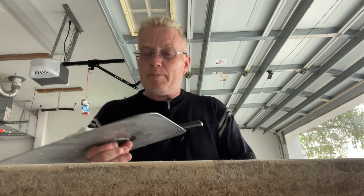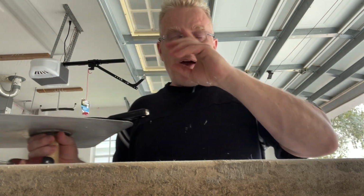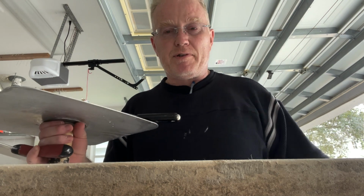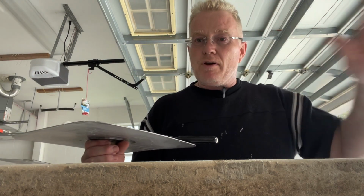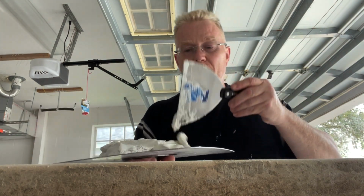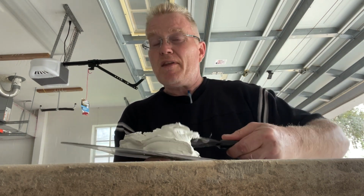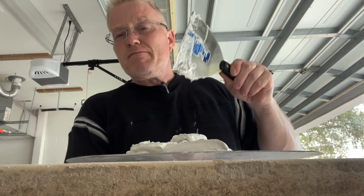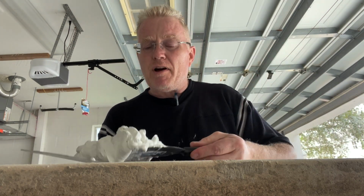I'd like to start hanging paper. But you and I both know that your wall or mine may not be 100%. And so after we have the entire wall 98% completed, we go in with a different mixture now. Same bucket, but water added, because it may not be 100% dry.